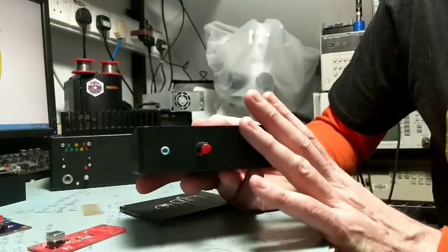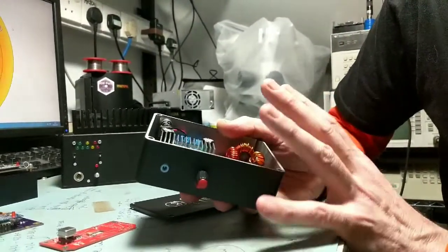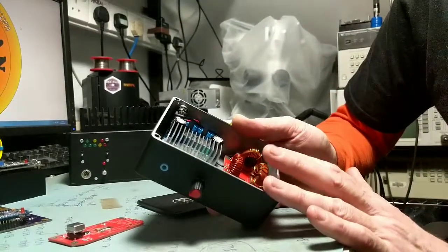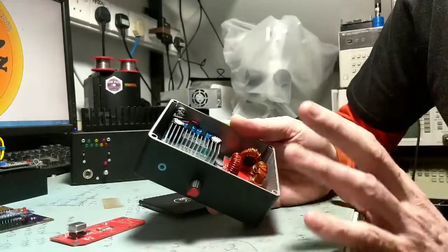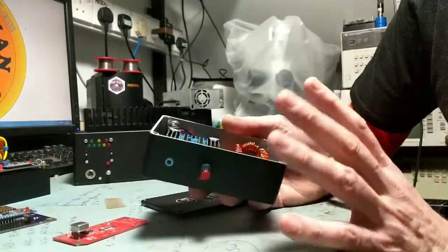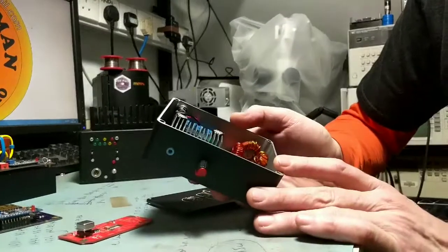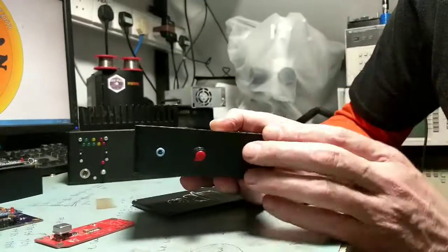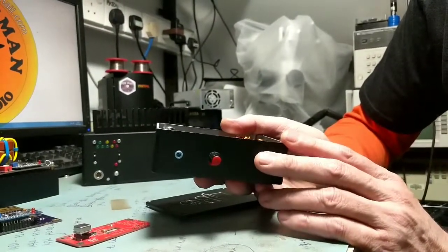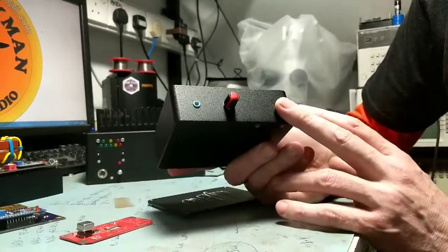This will work from 12 volts. Really, 14 would be better, but it will work from 12 volts absolutely fine, but obviously the power is a quarter, so it's only about 4 watts. It's normally 15-16 watts, half the voltage, quarter of the power, so only 4 watts. But for some people 4 watts is plenty, certainly better than Part 15, and quite useful for driving modern linears as well. There's a lot of FETs out there now which need 3 or 4 watts to drive them, so it would make a good driver for a FET amplifier.